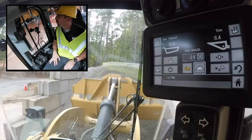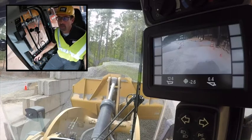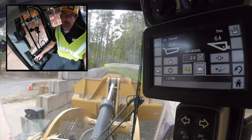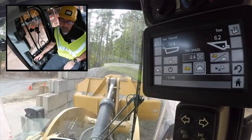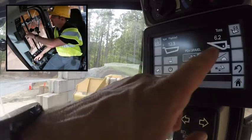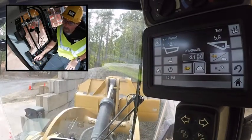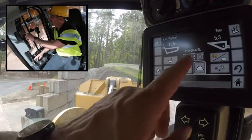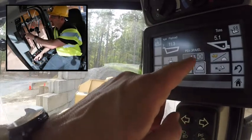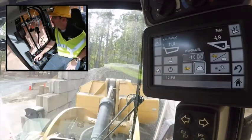You can see if I carry this 6.4 tons over, it'll be too much because I only wanted 10 tons. So I'm going to back out of the pile, making sure I don't rest that bucket on the pile. I'm going to start tipping, and as I tip, you'll see this material meter off. As it lowers, it's going to be less delivered material as well. So I can just basically tip to my target, and as this comes down, you can see my target remaining keeps lowering. So I'm trying to drive this down to zero — trying to drive this to my target of 10.